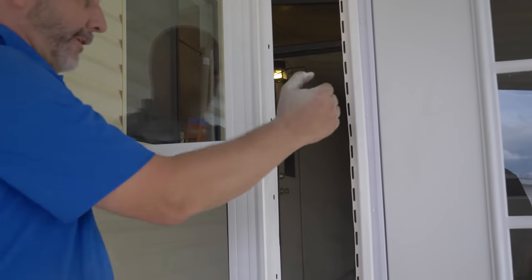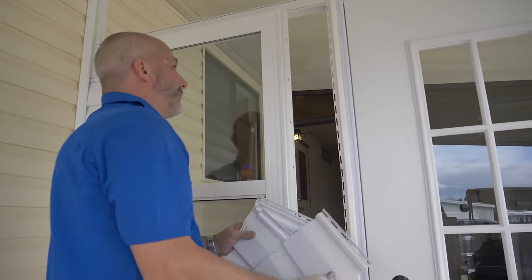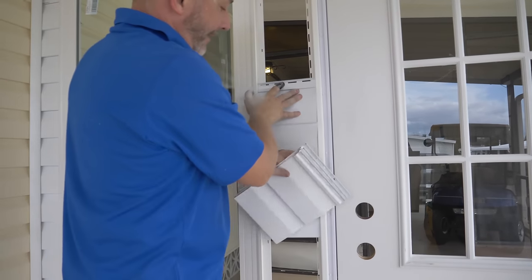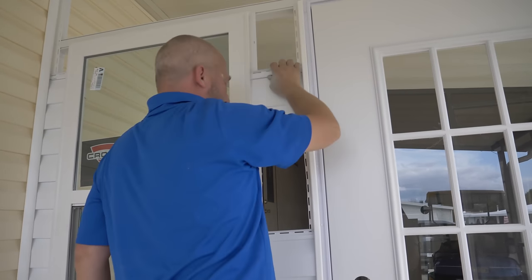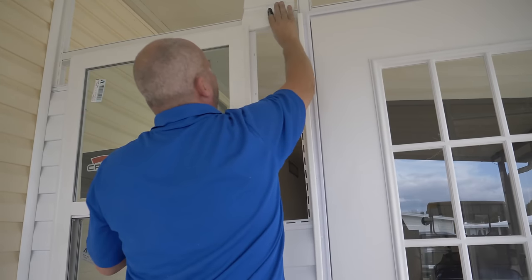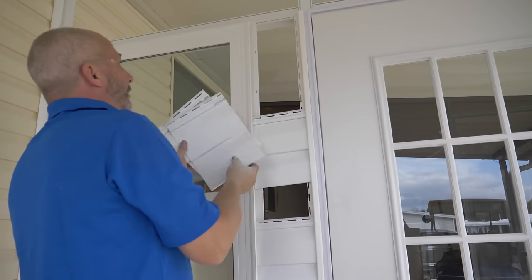When you have two verticals this close together, you don't need fasteners. It's hard enough to get this in, let alone pull it out. That's why we drop it in from the top. Because trying to put it in this way, well, that's almost an impossibility, right? Without breaking it. So it's not gonna come out either. Right? Now you can see the wisdom here. It also allows you to be pretty quick because you can do all your multiple cuts first and then bring in your siding.